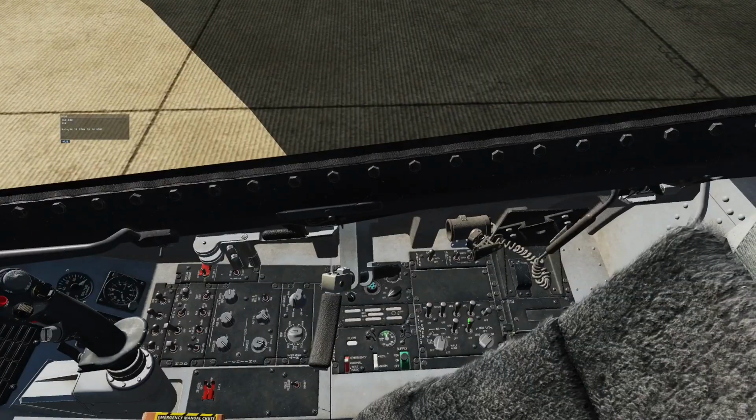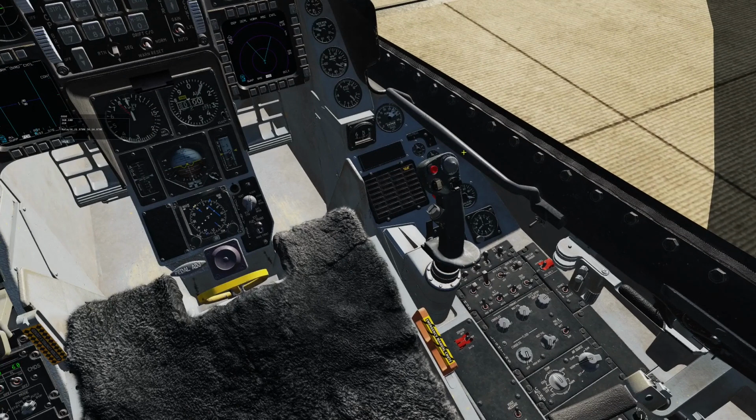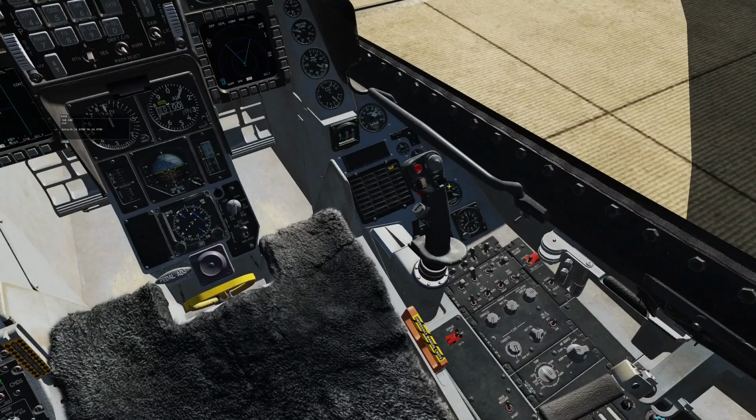All right, just doing a quick look now. Make sure I got everything. This is our oxygen panel. We do have OBOGS in this, so we're not going to have a LOX quantity indicator. Our Block 42s do, but not on these 50 variants. This is our EPU fuel in the event of emergency, and our EPU fires off and uses our hydrazine fuel. We got 10 minutes pretty much before that empties out.